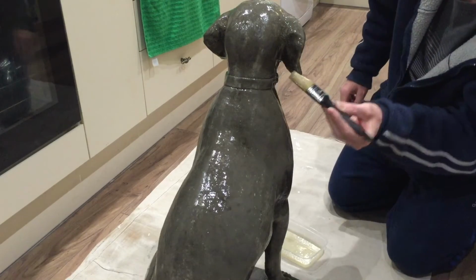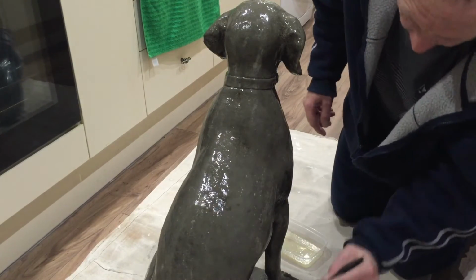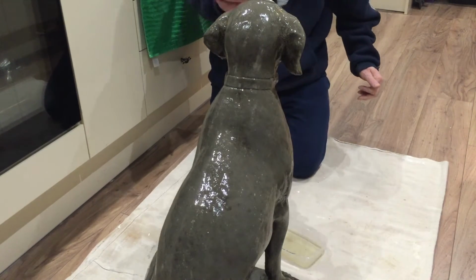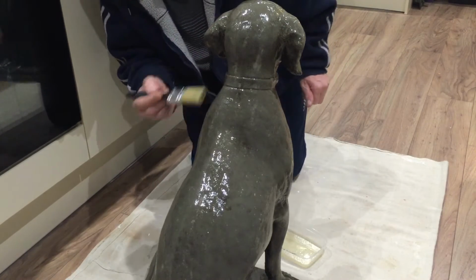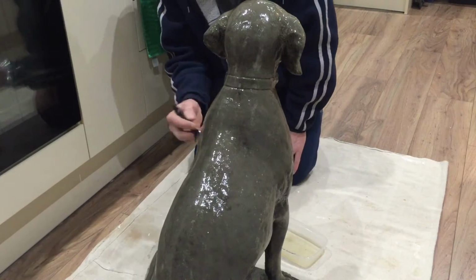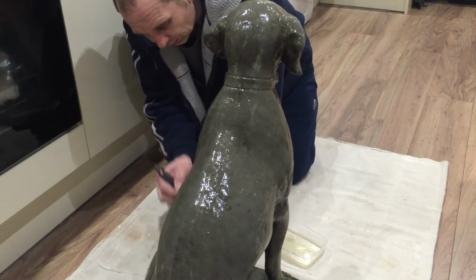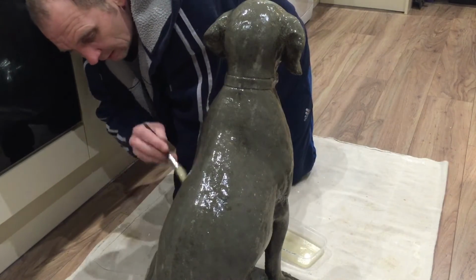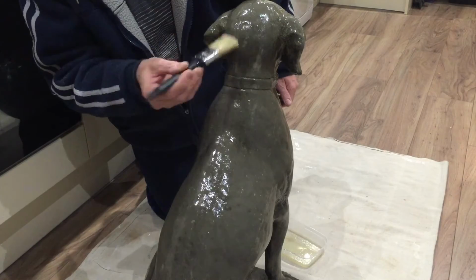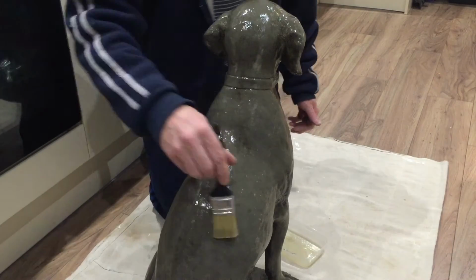And you've seen the result when you tip water on this, haven't you? Brilliant. But yeah, like I say, you need like 2 or 3 coats. And I've done most of this already. I'm actually doing this inside. If you're coating garden statues, which are overpriced, ain't they, or if you're doing your bricks, you want to be doing it in the summer, ready for the winter. I can't recommend this stuff enough. It's just brilliant. It just seals all your bricks up, stops them getting damp and soaking up water and stuff like that.